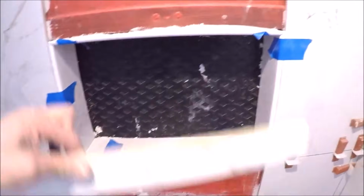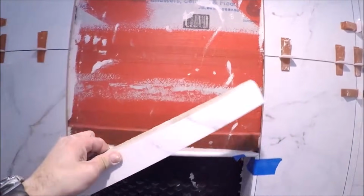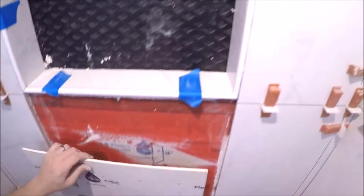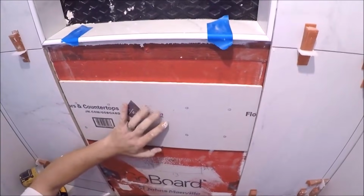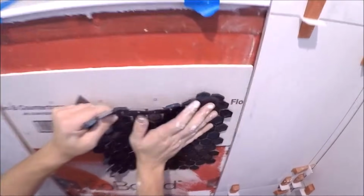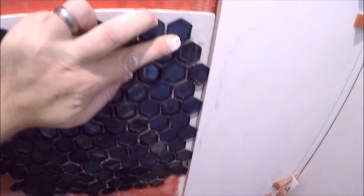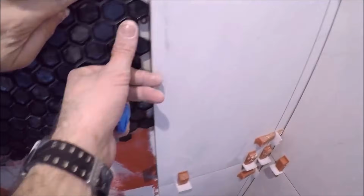One is to make a screed, something like this, where you can screed thin set onto the wall, let it dry for the next day, and then install your Mosaic. Another method is to simply install some 1/4 inch backer board, like so. We've got a 1/4 inch go board backer board we're going to thin set and screw to the wall, which makes up the difference in thickness and it allows us to install our Mosaic waterfall stripe nice, smooth, and very flat.